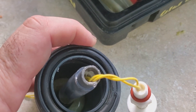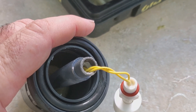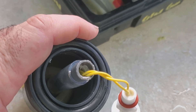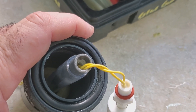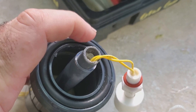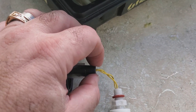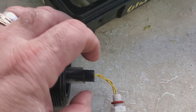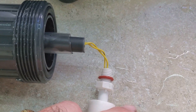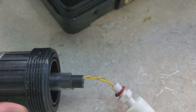I was going to tap the top of this, but there's not enough strength in it. I tried to use a strip remover — a reverse threaded corkscrew — to pull out the old float switch, hoping it was just threaded in here, but it wasn't, and that alone was starting to twist and bend the pipe. So if you're in this situation, just break off the float switch right at the tip and then drill out the base of the float switch. I believe this is a five-sixteenths drill bit hole. I drilled that out and this actually threads in pretty nice and snug.